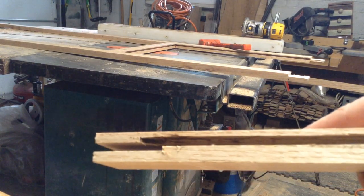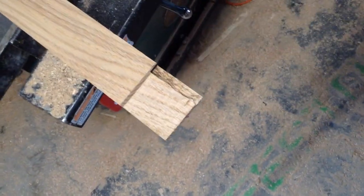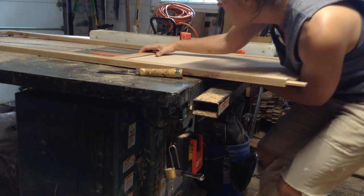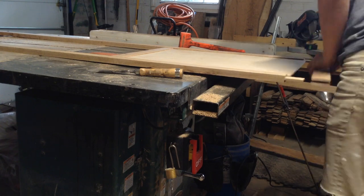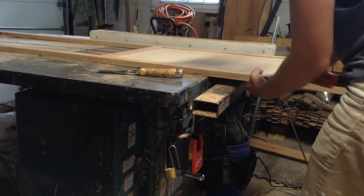The finished product — there's a little more material removed so the panel will fit, and I continued it down with the router so I could slide the panel in the bottom. It's pretty simple stuff, quite similar to making cabinet doors which are fairly easy to make. Line everything up, attach that bottom rail, and then these are ready for glue-up.